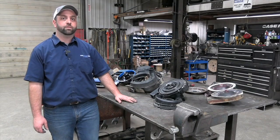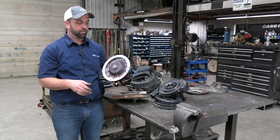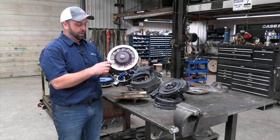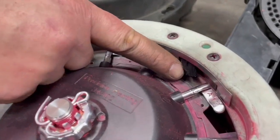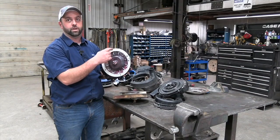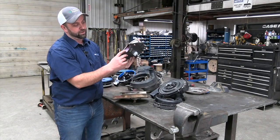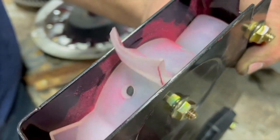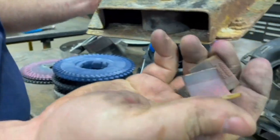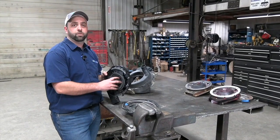What I want to do now is talk a little bit about corn meters. This is still our tried, tested, and true — still the most popular meter we sell. This is a finger pickup; it's been around for a long time. I want to quickly talk about life expectancy on some of these — we want to test these every year. Our seed brush here, we're looking at 100 row acres for replacement. On our finger set, we're looking at 600 row acres for replacement. And on our back plate, we're looking at 250 row acres for replacement. These things are set — there's a torque here, it's very important. The other thing we want to do is spin this around and have a look at our belt every year. Make sure it's nice and supple, make sure it's not missing any fins, make sure there's no cracking. I've got an example here that's quite extreme — this is a belt out of an old seed meter. Just something to keep in mind.